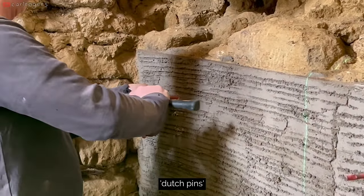To fill this new gap in the mortise, I cut up some seasoned oak so there shouldn't be any shrinkage and hammered it in. But I wasn't too happy with the fit of the first one, so I whipped it out and tried again.